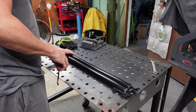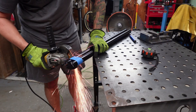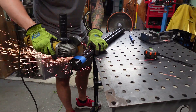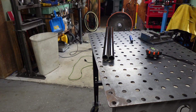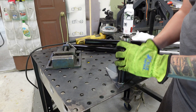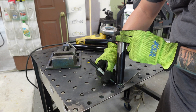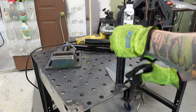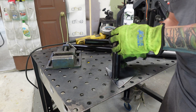Alright, time to cut the fork. We're not going to need the bottom brackets because we're going to use our own, so we're going to cut those off. I like to try to tape them together so that I can make sure I'm cutting both at the same time, the same length, no questions asked. Now we're going to cap those off — now that we've cut them there's a big huge hole, so we need to cap them. We're going to grab some 16-gauge steel and we're going to use a piece of the fork that I already had laying around to trace the circles the best I can.